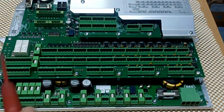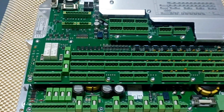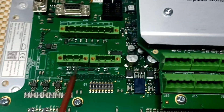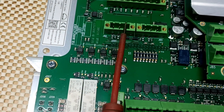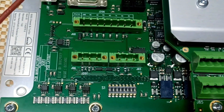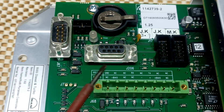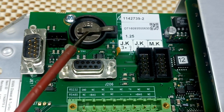So we have now covered all the J connectors. The other connectors are: J65 and J66 are for network connection, J67 is for the service terminal, J207 is the dongle key connection, and there is also a battery backup connector here.